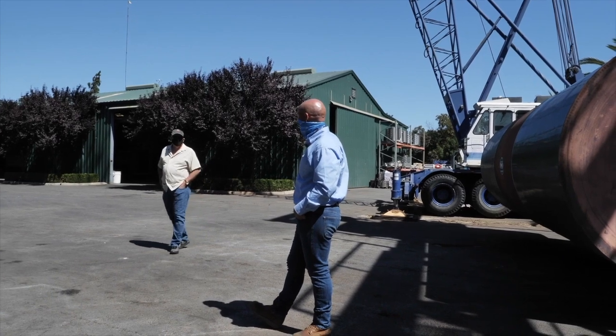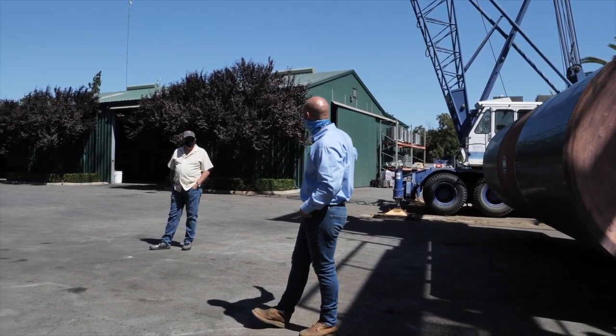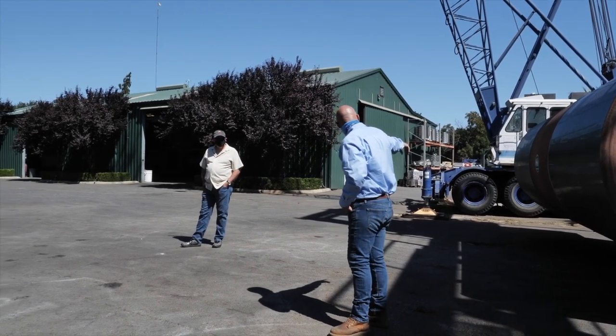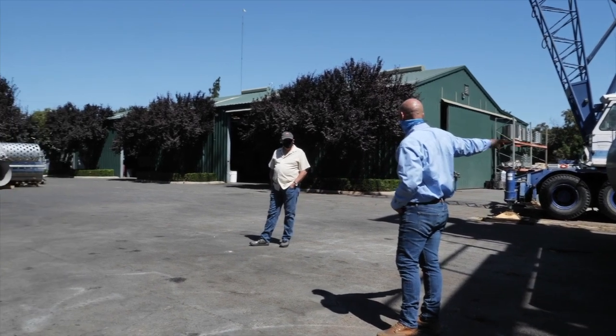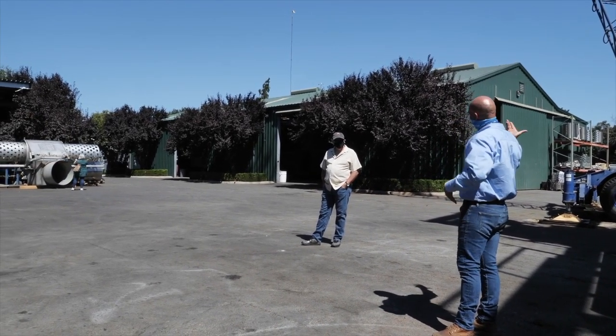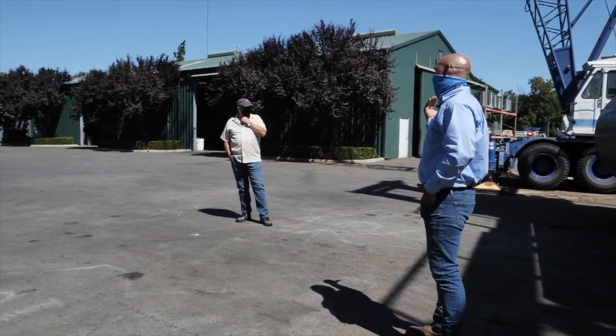Yeah. And I was going to say we've recently added a submersible pump in the screen. And so we'll just have it coupled right here in the back. It's just like the same motor as our drive units. It's just the third motor. And then we can plumb that to a spray bar on the brushes or blowing down. And so we're doing that on a project for ice.